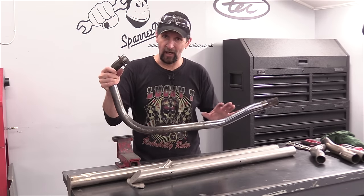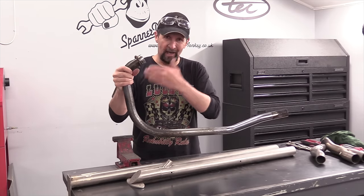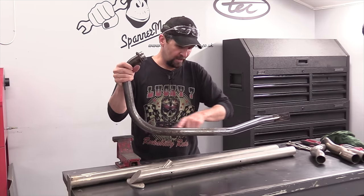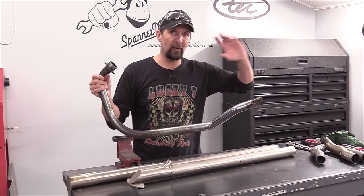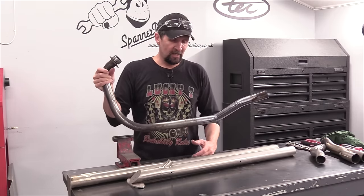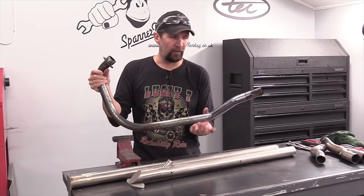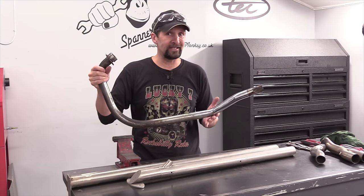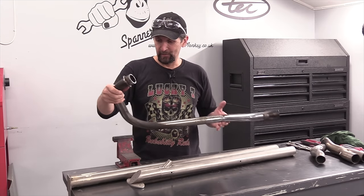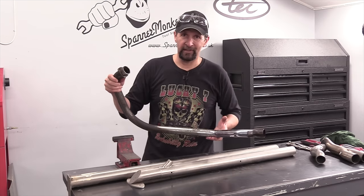So these will clean up. Now, that doesn't mean I'll use them, but what it does give me the option is three downpipes that curve properly under the bike. Then it might be, if I can't make a bespoke, complete high-level system, I can make a joiner, a 3-into-1 collector at the bottom, straight up to an exhaust silencer, job done. So this could be a lot easier job than it looked to be. Nice to have another option, if nothing else. Anyway, where was I? Get on with it.